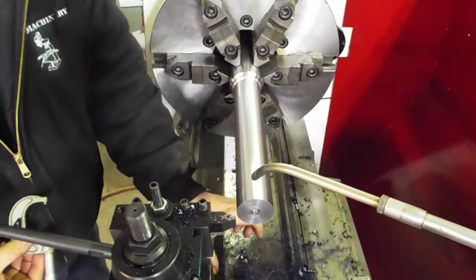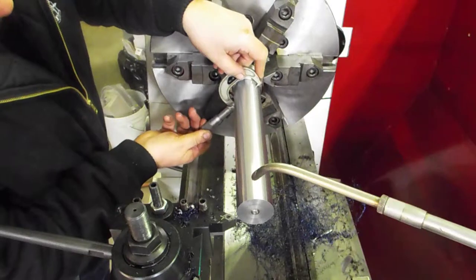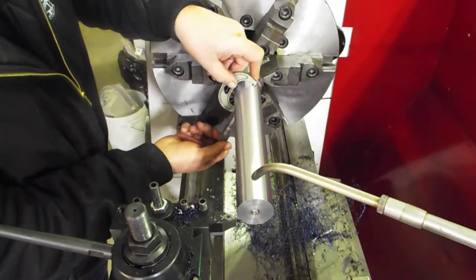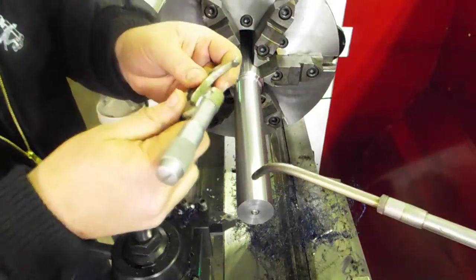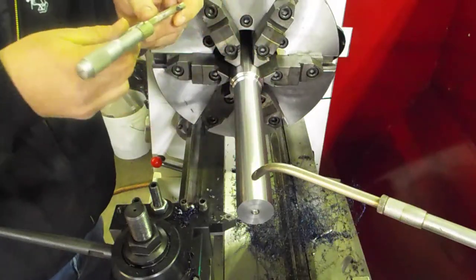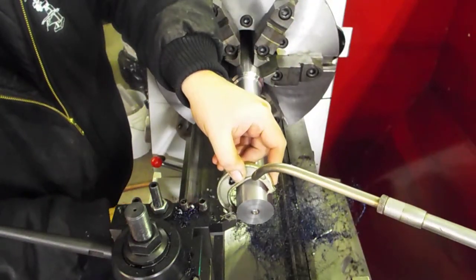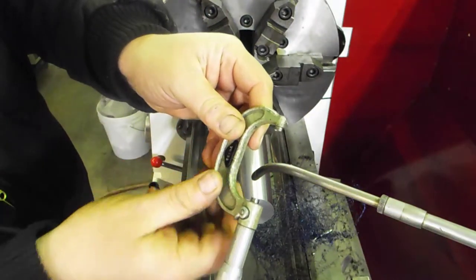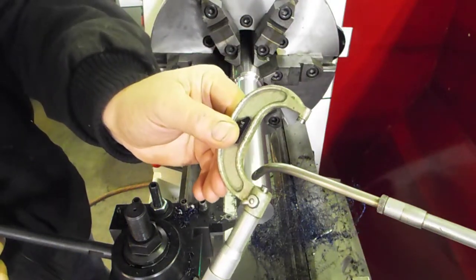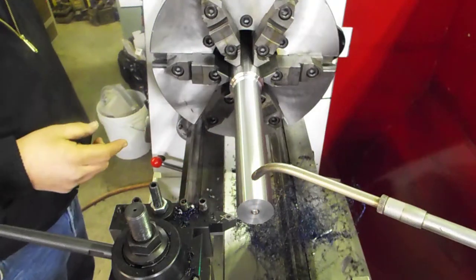As you can see, you can peel a pretty good chip here — you can look at the size of that. Right around the 15 there. And you can see right around the 15, or just a shy of the 15 again. And we're just a little shy of the 15 again. You can see we're holding somewhere a little under — looks like about a half thou. We're better. And again, we're cutting about 11 inches here, unsupported by any piece here. That's why I'm doing the light cut.